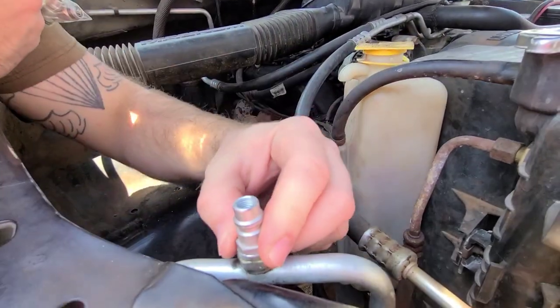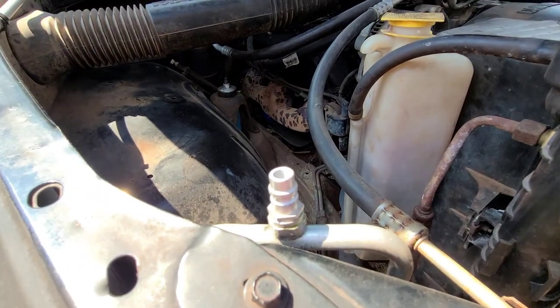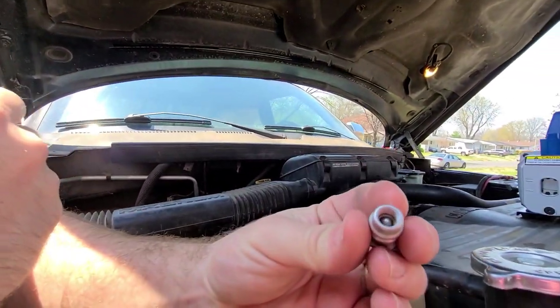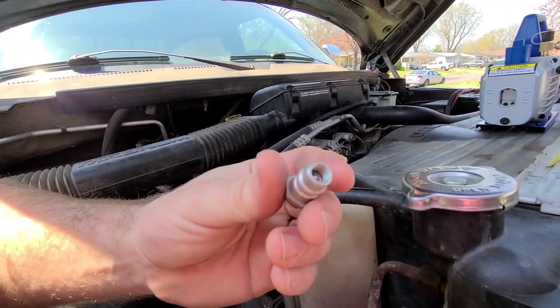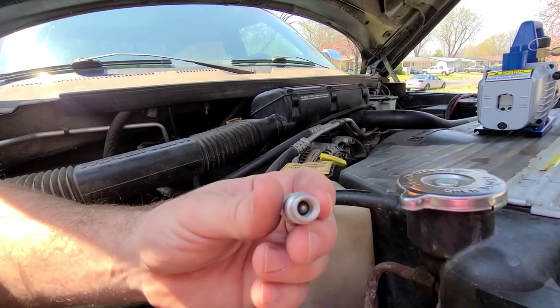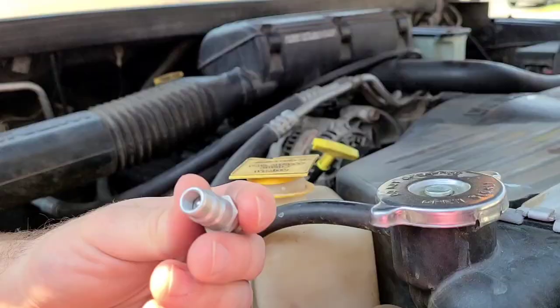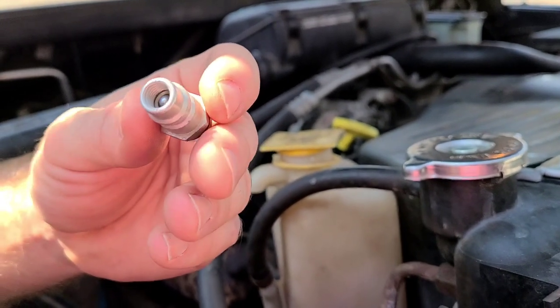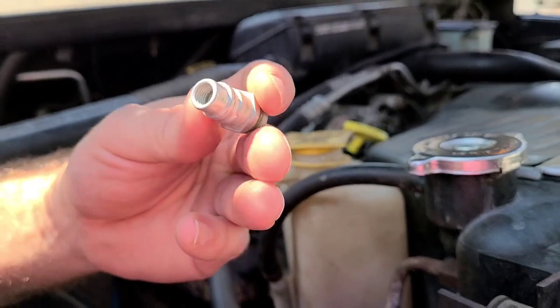And because it had broken off, this valve, I'm gonna show you how they look here. These are not Schrader valves on this year. It is a different valve, see it? So I tried to remove it because it was leaking, with my Schrader valve kit, my Master Cool, but I couldn't tell that it was an old different design. Can you see it kind of? Like it's like a ball. Because it was filled with fluid when we opened the cap, right?